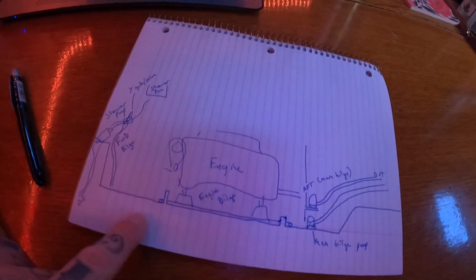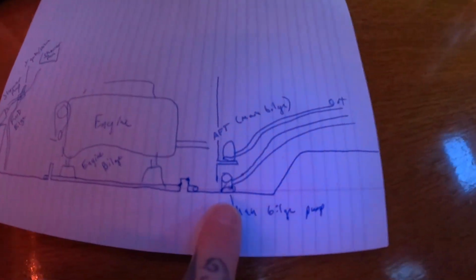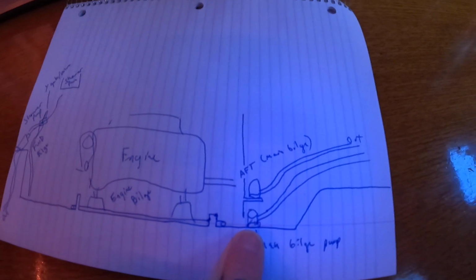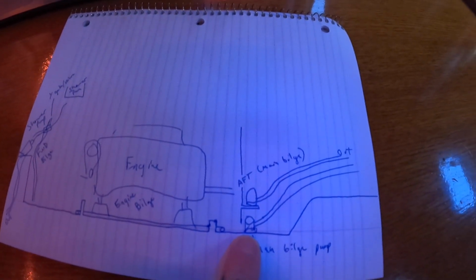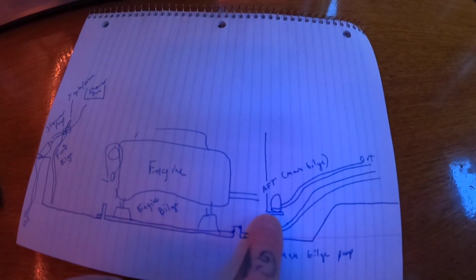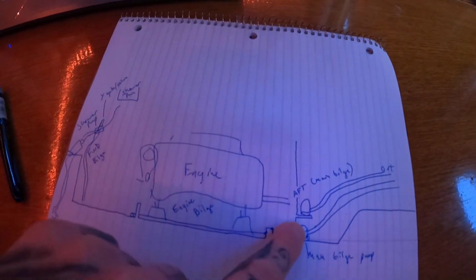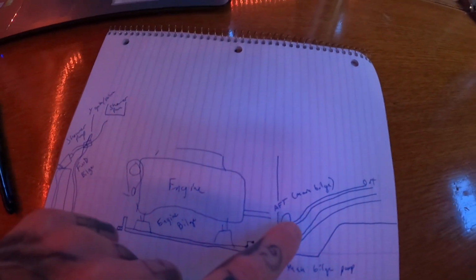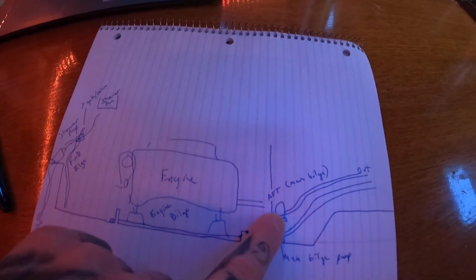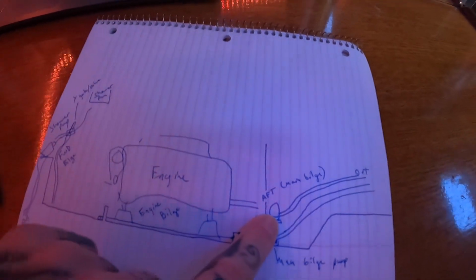So the pipe here, like I said, connects the forward and aft bilge. Now we have our main bilge pump, which is automatic, but if that ever fails or doesn't have the capacity to deal with the amount of water ingressing the boat, then we have the second bilge pump, which is the emergency one that I just rigged up on that yellow platform, just above the top of the main one. And if water reaches that platform, not only is this bilge pump going to kick on, but we're also going to get a visual and audible alarm down here in the cockpit.